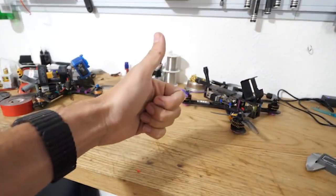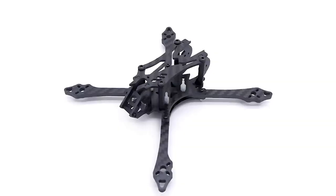You're going to want the main plates to not have a lot of lightening holes. The older frames had so many unnecessary holes — how much weight are you saving by cutting out all these little triangles when you're really reducing the structural integrity of those plates? So you want solid plates, you want thick carbon where it matters. It's going to be a little bit heavier, but that's the trade-off that you're making.